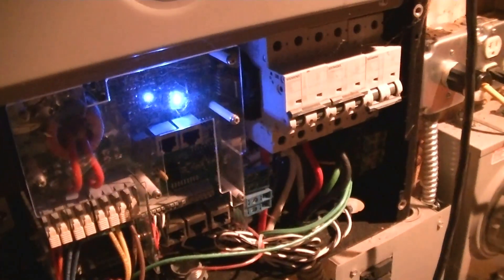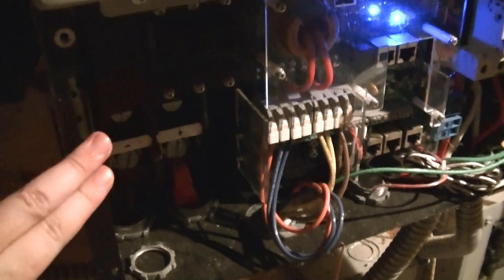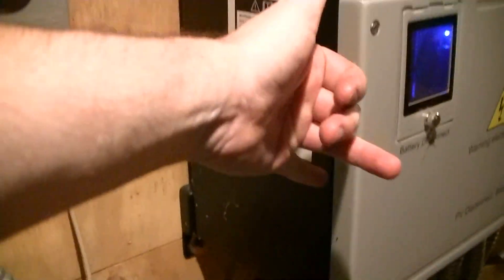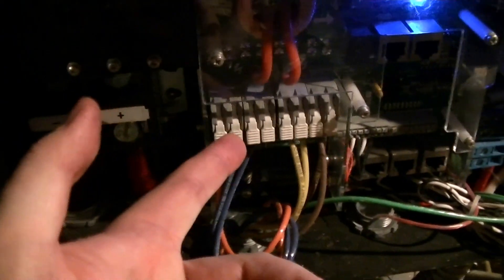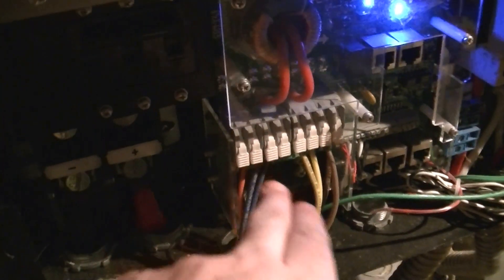For comparison on something that's a lot easier to wire up: Solark. So much more space. This is a very early build date Solark 12K — October 2019, actually, one of the first ones made. On newer ones, like this one which is June 2020, it's even bigger. So much easier to wire up! And it does things properly — you've got proper terminals to land your solar feeds on. That other inverter, being largely made for the UK and South African markets, has MC4 connectors on the inverter itself, which... unless it's a micro-inverter actually out at the module, just no. Half these things have screw terminals, but...